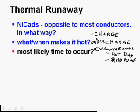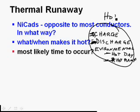Well, as soon as we get the first engine started, we're going to turn the generator on, and so it'll start charging it, but we're immediately going to start up the second engine, and the first generator won't put out enough power to start the second engine, so we're going to discharge it a little bit more. Then the second generator will get turned on, and then we're definitely going to charge it up a lot. Well, we had a hot day. It was already hot. A hot ramp made it hotter. We discharged it 2.5 times, and now we're charging it like crazy. So guess what's happening to it? All of these things are making the battery hot.